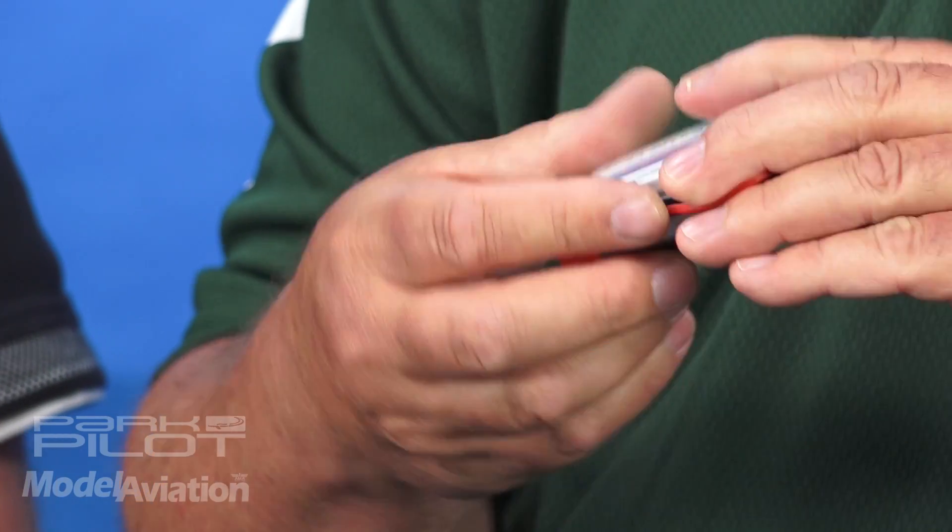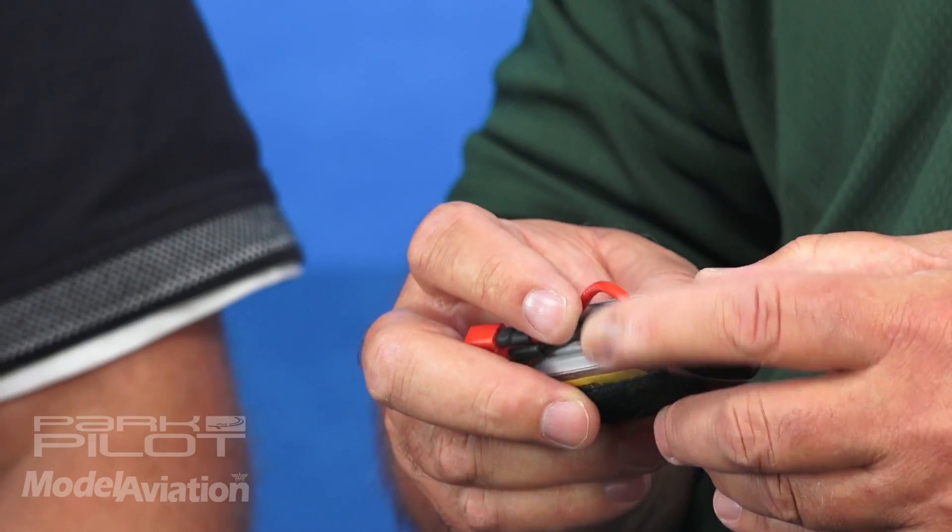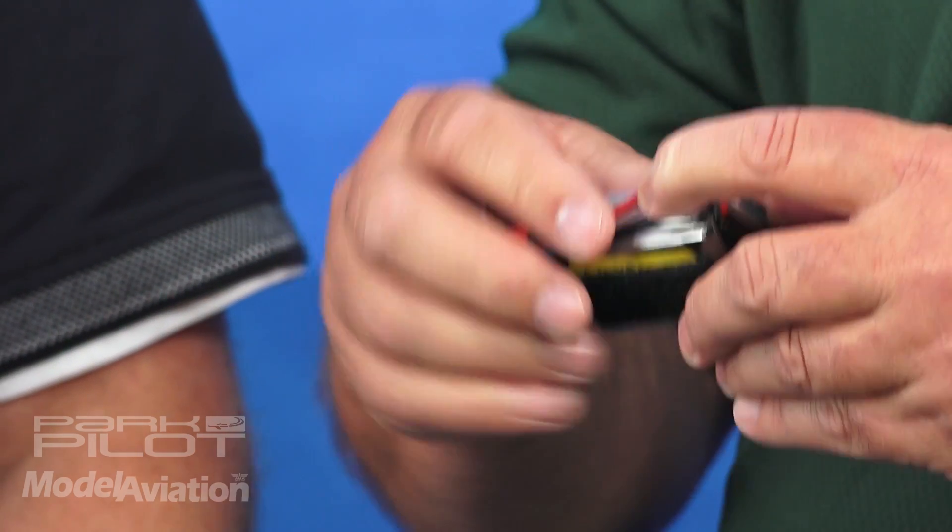The other thing is they really don't want the wires to flop around. So just fold them down to the side of the pack and put a rubber band or a piece of tape to hold them in place so they're not moving around a lot. Then put them in a lipo sack. If you can pack them in a lipo sack — my recommendation would be to get a big lipo sack and put that in another bag. If these packs are taped together and the wires are held down so they can't move around, they can quickly inspect them.